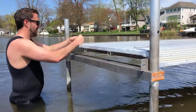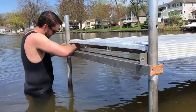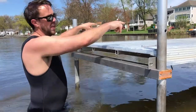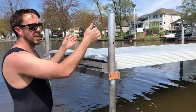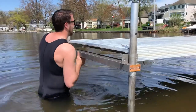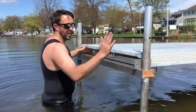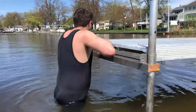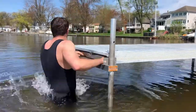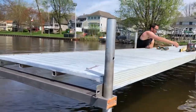Put my bolts in here. You always want to make sure you've got a tight gap on both sides, because there is a little bit of play — your dock can kind of snake back and forth if you don't have those tight. Sometimes you've got to jiggle it around. You try to get it so that those gaps always stay tight. If you have to keep pushing on it, something's pulling somewhere — usually it's because the support's not totally vertical. We have some of the pole stuck through the foot pads, so you've just got to sneak those down in. We've got nice, tight gaps, so we get there.